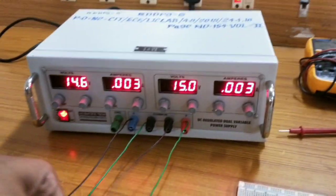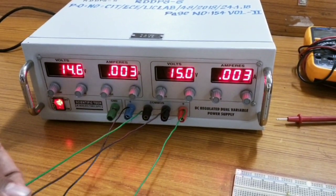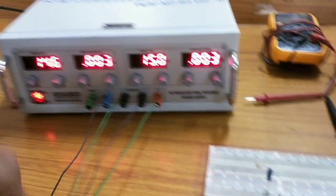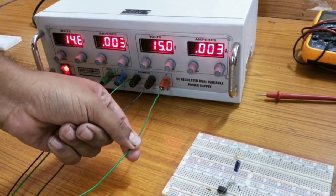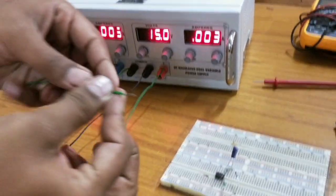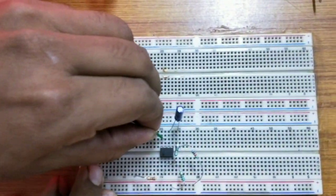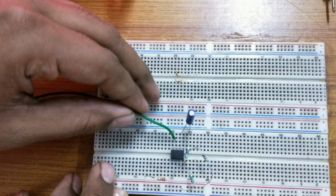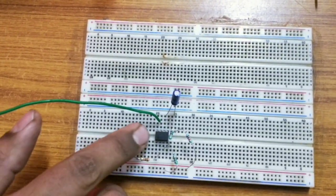You must have two individual power supplies, out of which the positive of one power supply is connected to the 7th pin. So this is the positive terminal. I have connected this with the 7th terminal of the IC. So you all know how to identify the pin — you have to start from the dot position. So in the IC, you can note down the IC dot.